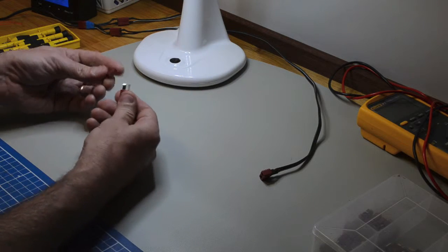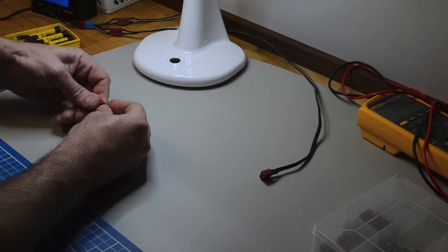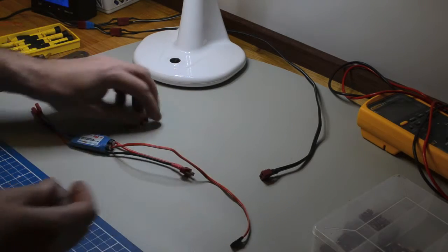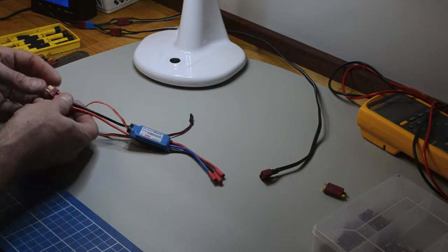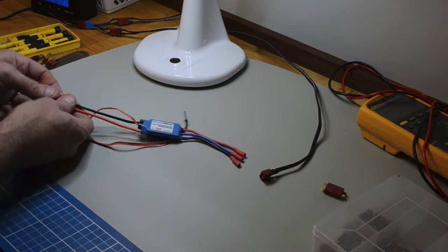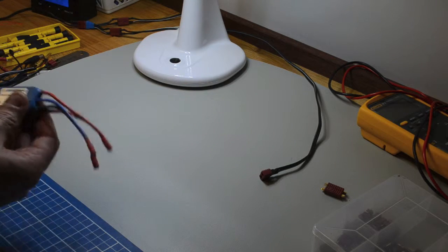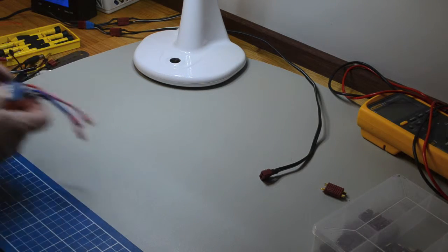It's quite a solid, beefy connection system, and you can hook them together and make connections to really whatever you want to connect up. It all came from these things, which is what's called a speed controller, and you have batteries that plug into units like this with that sort of plug. You can get different types. I'm not saying Dean's plugs are the one that you need to have, but it can be very handy to have a certain kind of plug that you like that lets you just standardise and use the same plug throughout.